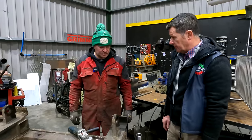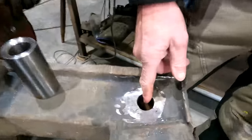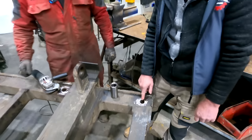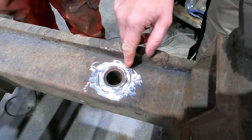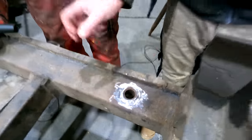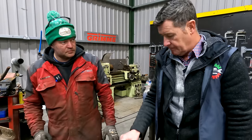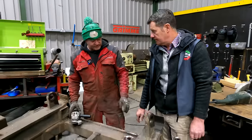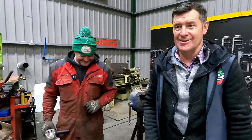We have Marco working on the bale fork - it's in a bit of disrepair. This bushing is completely gone - see the bushing on that? It's cracked all around there. So what we're going to do is take that one out. This one here actually doesn't look too bad and we might not have to replace that one. We're going to put a 10mm washer in at the back of it to help support it as well. We'll put a new bushing in and then the fork should be ready to go. It's a little bit awkward cutting it, but we've got the right man on the job.